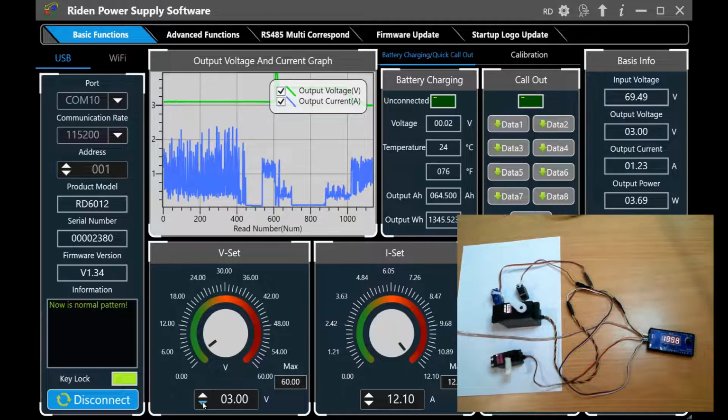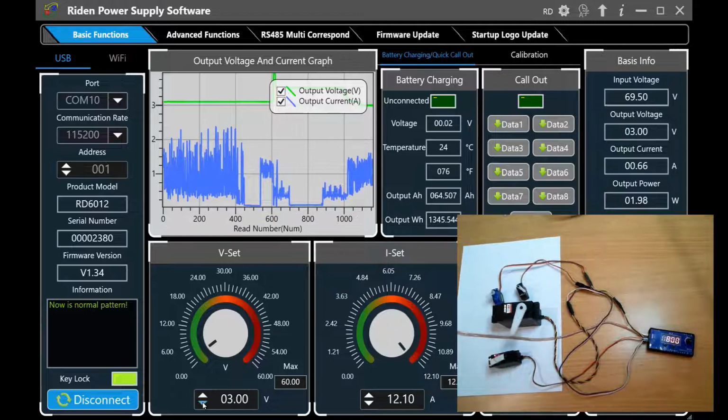The HS-805BB from HiTEC is working fine in one direction but jumping on its way back. The MG996R is intermittently jumping around and jerking. You can see it actually shaking the whole servo in the process of doing that. But the little SG90, which is a Tower Pro, is absolutely hopeless on the low power.